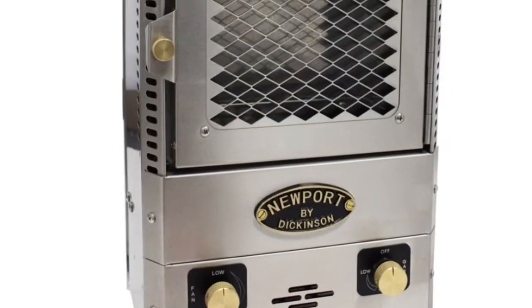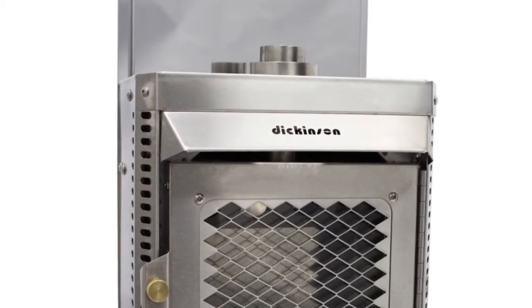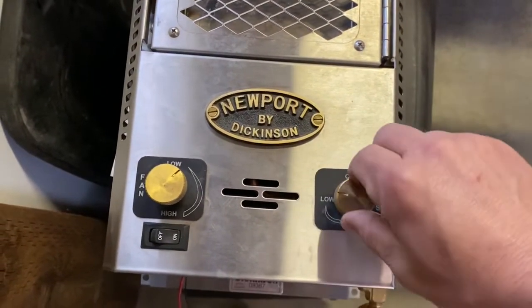Really the only thing you can get for small spaces in a kind of propane fireplace is the Dickinson Marine P — they have two models, a small one, the P5000 or something. It's a solid unit and a lot of people use it, but it doesn't really look like it belongs in a home and there's no thermostat on it — just low and high, that's it. So if I'm heading out of town for the weekend, I have no real way of maintaining that heat at a set level. Either I'm keeping it too warm or maybe not warm enough.